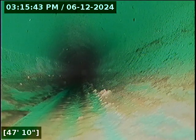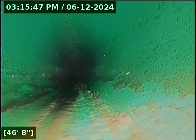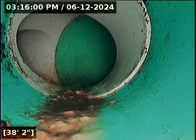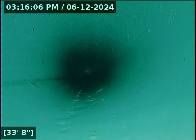So it would appear here that my guess is the house adjacent to this one is lived in. You've got a tiny bit of grease film in the flow line. That's why I'd know that. That would not be there if this were brand new and never used pipe. Thin little layer, no big deal. And you can see how much cleaner this pipe is than that one.